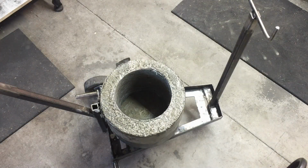I tell you what, I did not expect that to come out so easily. That glad wrap I wrapped around the metal form in the middle really worked fabulous. The refractory stuck to that. You can see some of it's still inside the main body here, but it didn't stick to the metal canister, and I think that's just saved me a lot of time and effort trying to get that metal canister out. That just came out. Couple of taps around the side and just lift it out. It's just amazing. So that's maybe something other people can look into when they're making one of these